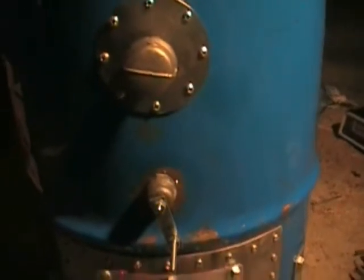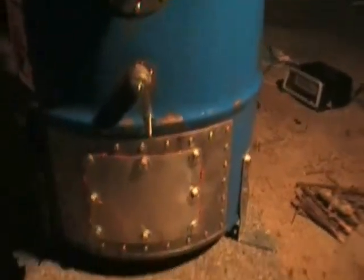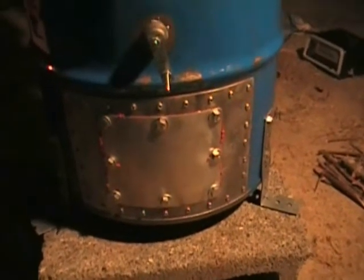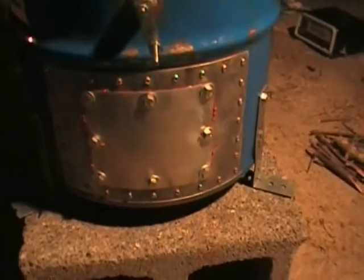There's my ignition port — I didn't even weld it in. What I did was cut the hole, made a steel donut for it, and made a compression ring out of aluminum foil. Combined with RTV cement, when I tightened that down it made an absolute seal. The same thing with my handle — I used 450-degree plumber solder on that, with no issues whatsoever. I've tried to take a nail and see if it's softening up — it's not. The ash port is basically where I cut the hole in the barrel. I used two pieces of steel: the outer piece came off an old computer — a thick piece of steel that I cut, made concave, and shaped around to give the barrel tensile strength. Then I cut a smaller hole for the port to clean ashes out of, used nuts and bolts with the bolts welded on the back, absolutely sealed.